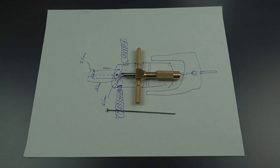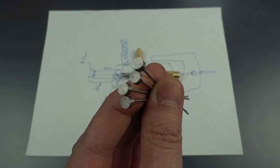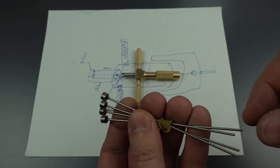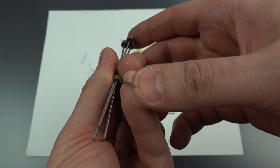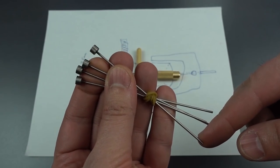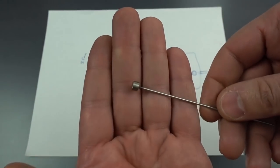Yeah. Very good. So here's what we ended up doing. And this actually came from a suggestion that I got on Twitter. We started rather with one of these rather than a solid bar of steel. These are ejector pins that are used in injection molding. What they do is the very little tip down here will go through the side of a mold and pop out apart after it's molded. This whole thing is made of one piece of hardened and tempered steel, so we're already part of the way there. So we just took one of these.